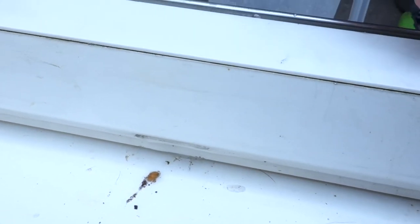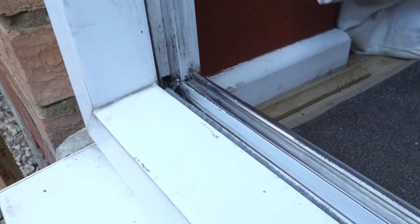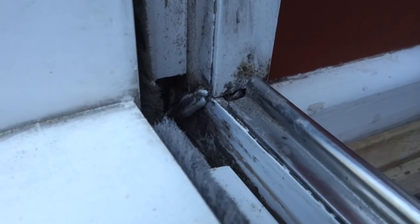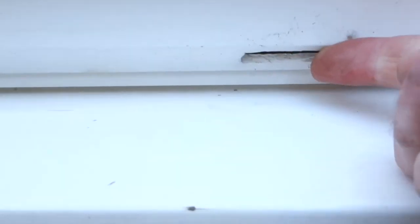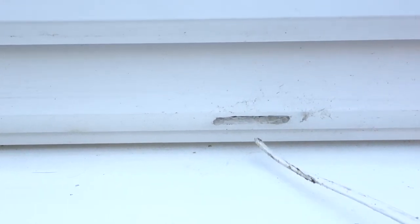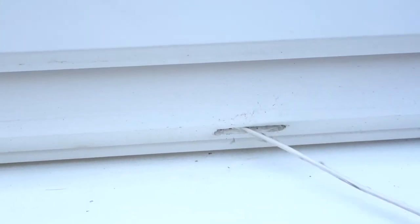But this here has to be clear — it tries to reduce the amount of damp moisture that will get into the inside of a house. No matter how new or how well maintained it is, it's vital that these drains are kept clear. Let's do it again to show you — there's the water, and that drain is clear. And I'll show you where the other one is — here's the other one. If the water level got quite high it would also come out here, but you still have to poke something in it. Old spiders and everything in there.